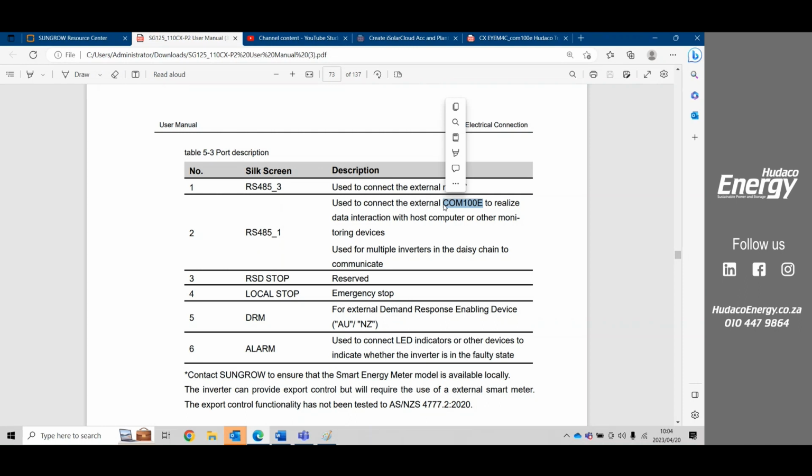But with any grid tie inverter, you need to have a voltage, and you also need to have a frequency reference that is supplied by the grid. So if the grid fails, the inverter switches off. Now we find that a lot of customers are using diesel generator integration, and that could be Elam, Ecombi, Nuvo, or the Wattman. So then you have your inverter running in conjunction with your diesel generator. The diesel generator provides 30 to 40% of the load, and the solar power can then supply 60 to 70%.